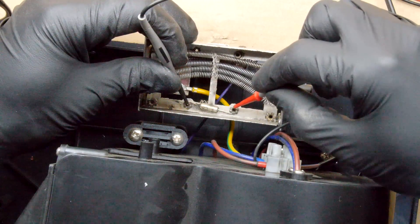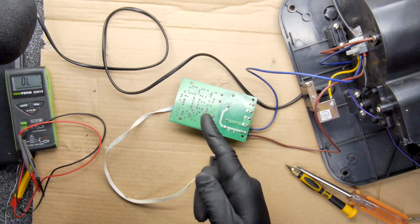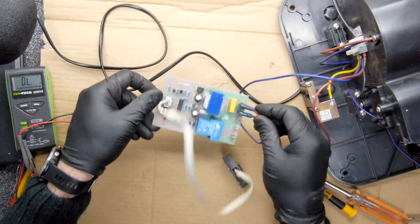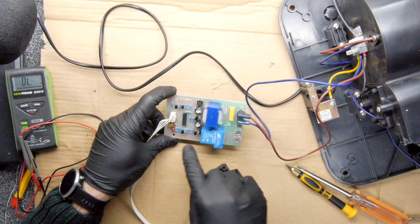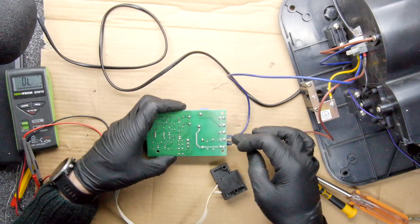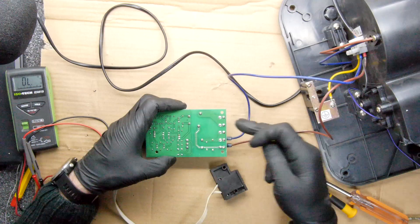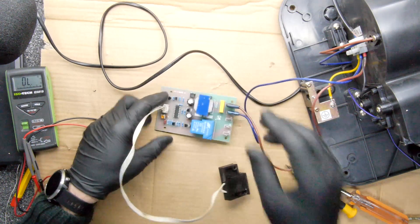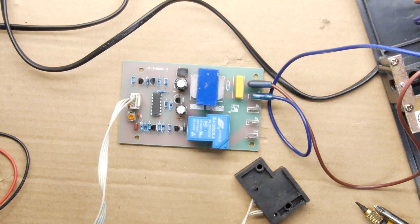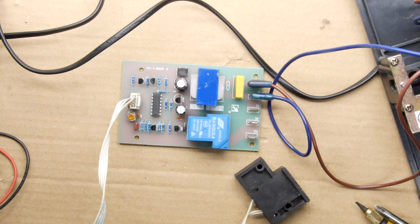So you could salvage this with some new heating elements, but there's no life in the unit. I've actually totally pulled this out — it is still connected to mains power, although the mains power isn't plugged in. This is the power input to the board, and you can see it switches a live line onto a rail from a common neutral, giving two live outputs. A bit like a glorified hairdryer. I'm going to plug it in now and listen to see if it clicks — I didn't hear a click.